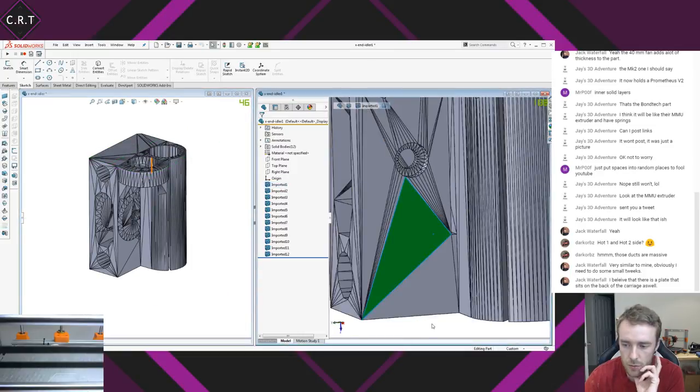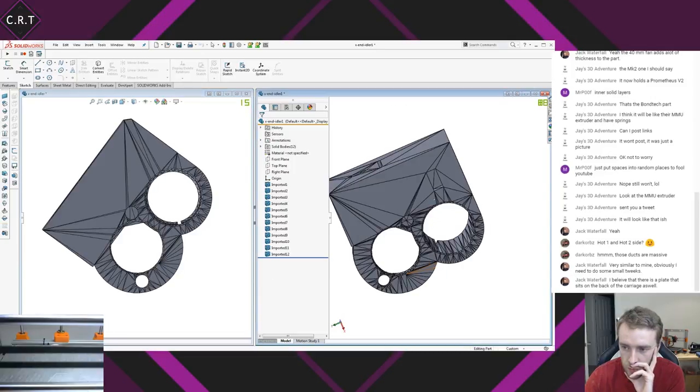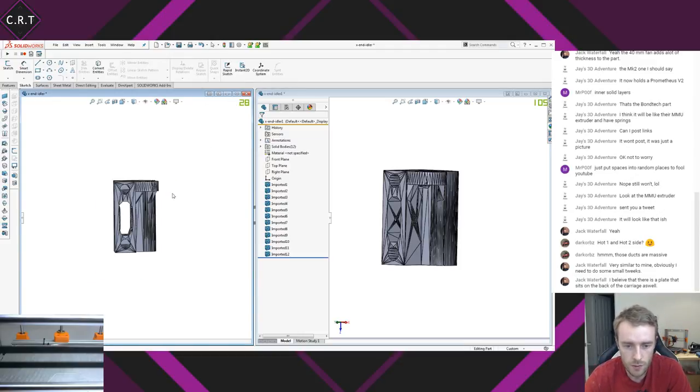Interesting. I think they've added a couple of chamfers as well. Yeah, so they chamfered that corner. Not sure why specifically that one, but interesting. So slightly messy part, that one, but they've obviously needed to offset that gear slightly for whatever reason, presumably any change they've done on the X carriage. They've probably moved the belts slightly closer towards the extruder side. So they've had to offset the belts by 3/4 mm or whatever it is, and so you get this weird problem.